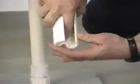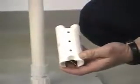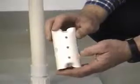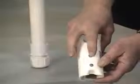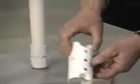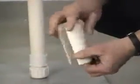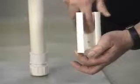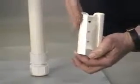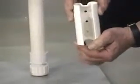We have 1/4 inch holes in this bracket, which can be easily fastened in with stainless steel screws down to about a number 8. You can also use this bracket as well if you run out of these brackets, but this hole would take a number 12 screw or bigger, otherwise the screw would pull through the hole. How I do it, when I fasten this bracket into the riser, I will place a stainless steel screw in the center hole, and then I take a level and level this with the screw fairly tight. I'll level this and then add 1 or 2 more stainless steel screws to hold this in a good vertical position.